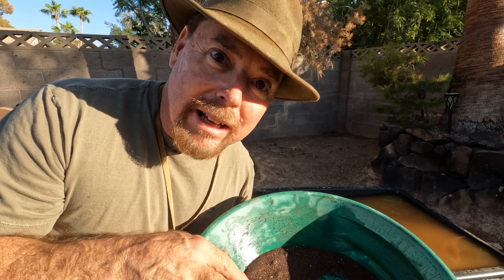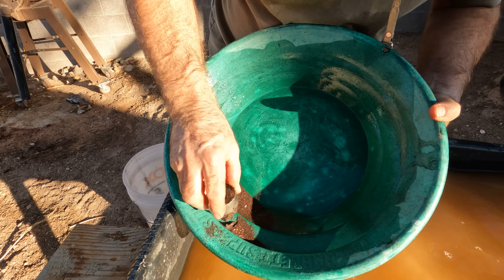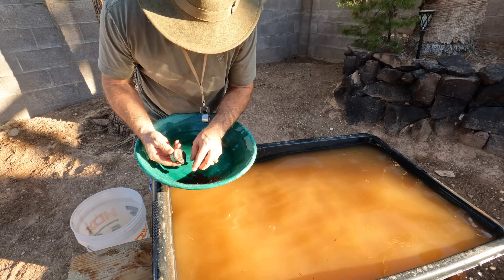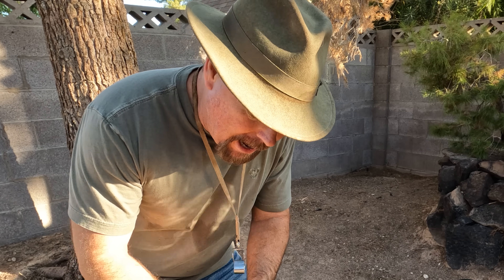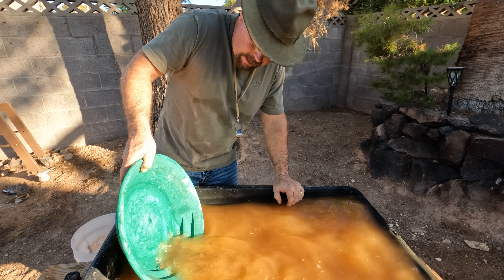I'm panning this stuff out to see if I've got any gold. If I really wanted to get crazy with this I could mix one-to-one ratios of litharge with it, get a big nasty lead bead, then cupel it and get the gold out that way. But I'm going to pan this first to see if there's any visible gold — I'm not wasting all my time until I know for sure. And look at this — now the sulfides are magnetic! That's because we took away all the sulfur. When you take away all the sulfur you've got nothing left but iron and possibly gold. Keep in mind not all pyrite has gold in it, but it can, and it can be a really good indicator mineral.